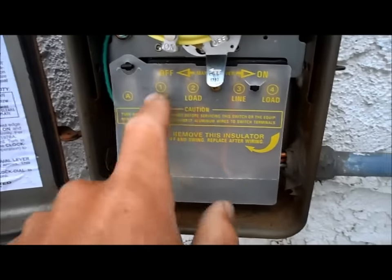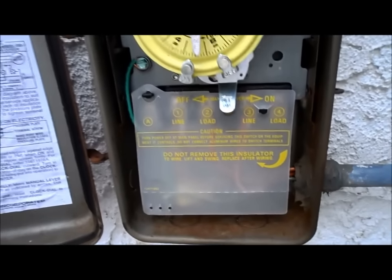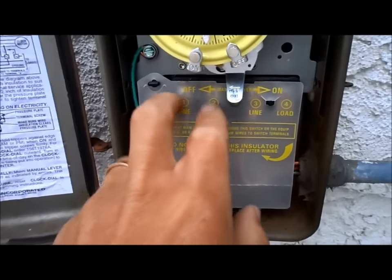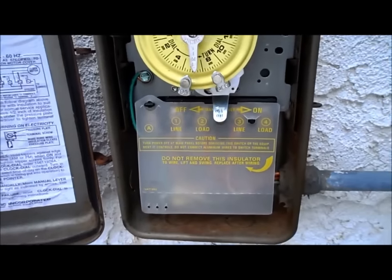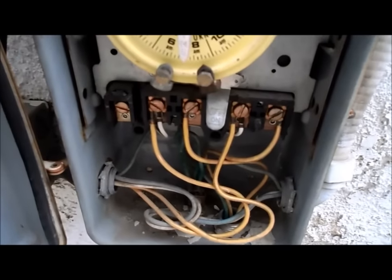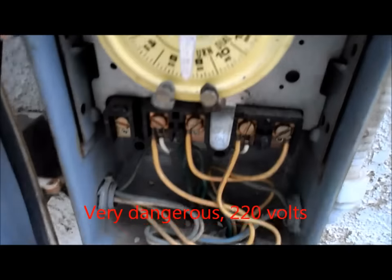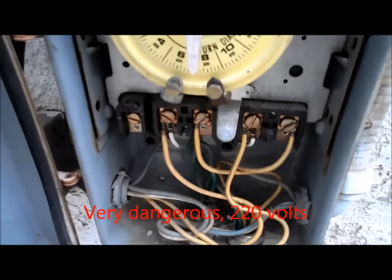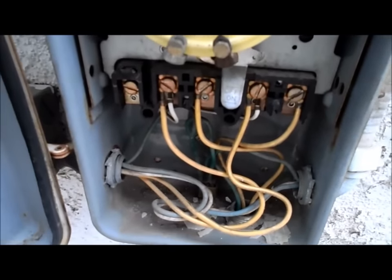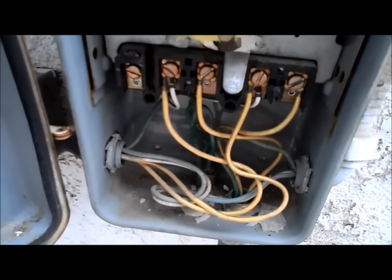This shield is important to have on here. These are live wires when the timer is on. If you touch these wires — I'll show you one that has a rip — this one the cover is broken and it wasn't replaced. These wires are live, so if you go to turn it on you can touch one of those. It's 220 volts, so it's very hazardous. You need to have that plastic shield to protect yourself, especially if you're getting out of your pool and your feet are wet — it would definitely cause a major shock.